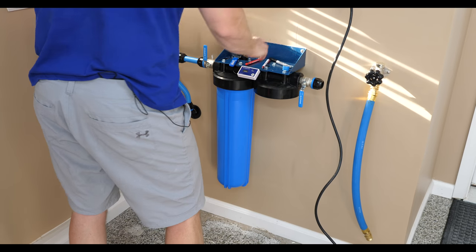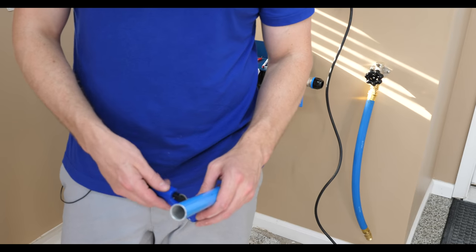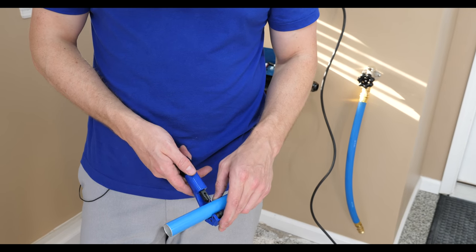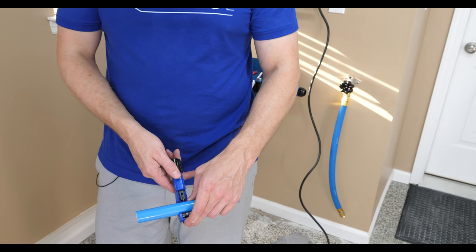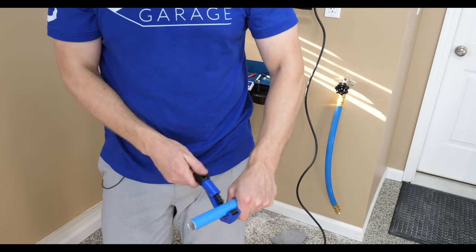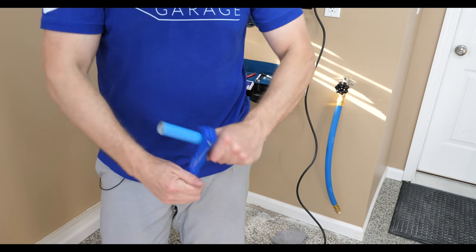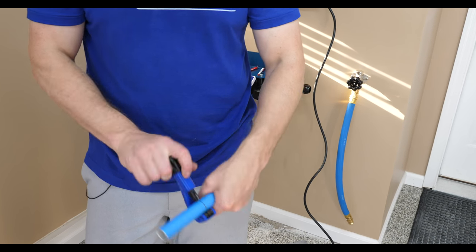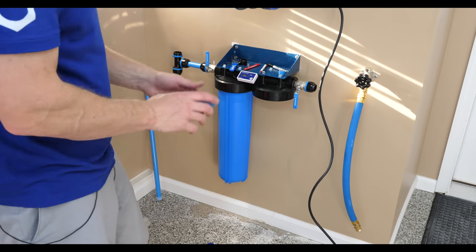Normally I didn't want to try to get my really awesome pipe cutter on the plane, but this is all they had at Lowe's, this little rinky-dink thing. So I'm going on my line right here. We torque it a little bit, right? Twist it, turn it, twist it, turn it. We just kind of work our pipe, getting a little bit more cut each time. Okay, so there's our piece. I think that's the one we need.